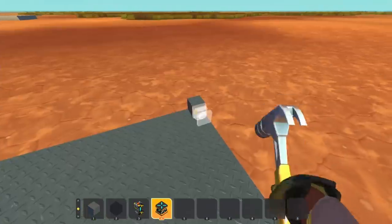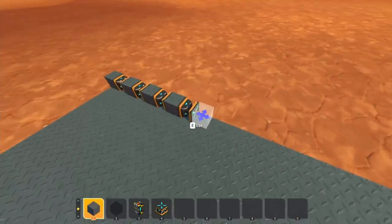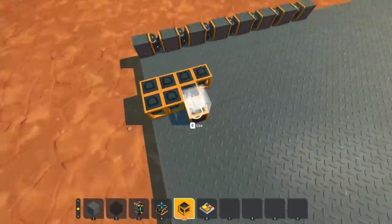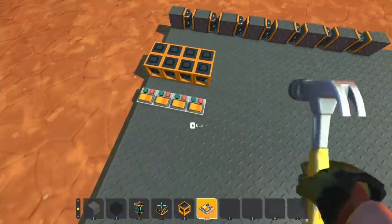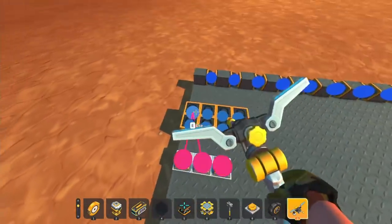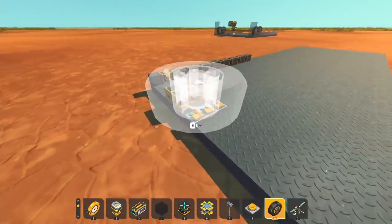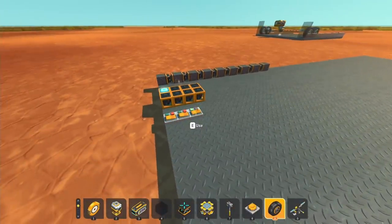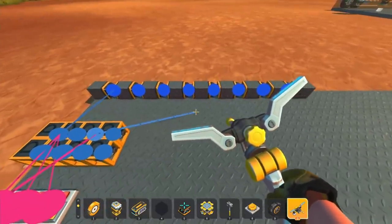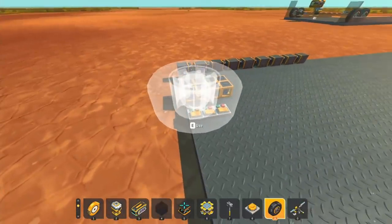I'm going back to the positioning system because there's just a small wrinkle in it. The main issue is that I don't really want to control each piston individually — instead I want to put in a single binary number and have that number correspond to how many pistons are being expanded out. So I hooked up the first piston, and if I press any of the switches it expands it out. That makes sense because the first piston should expand out if I'm putting in a number one or greater. I also hooked up the fifth switch — as long as the last switch is pressed it should expand out, and if it's not pressed it shouldn't.